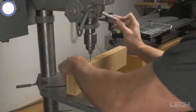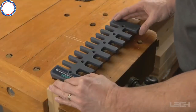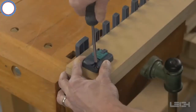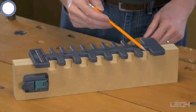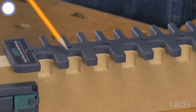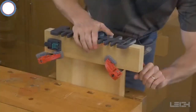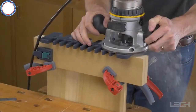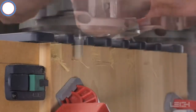A drill press or hand drill is used to drill pilot holes in the beam. The template is aligned with the pilot holes and the beam is secured in place with the provided screws. The side stop assemblies are then secured to the beam. To prevent tear out of your good material, grooves should be routed into each side of the beam. A nine and three quarter inch wide piece of stock is used to aid in routing the grooves, with the bit depth set at three quarters of an inch.